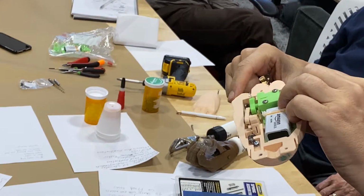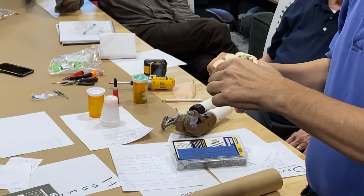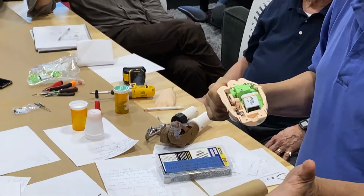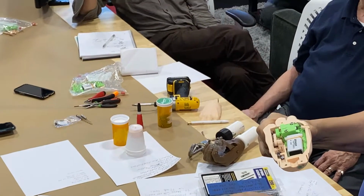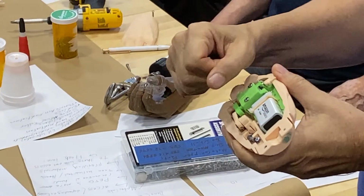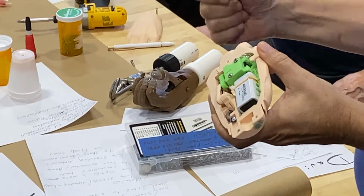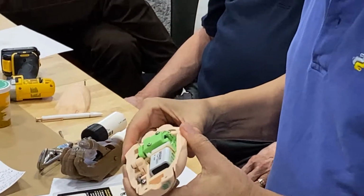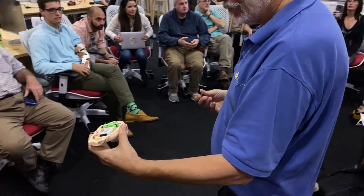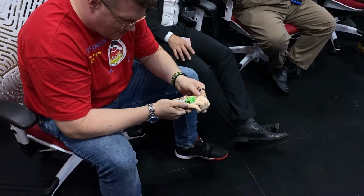So the magic, and you've got to think it through and watch it a few times, is that once you press the button, the cam allows the stay-on circuit to function. So the motor goes a full rotation until the cam hits the pole, tells stay-on to stay off, and it stops again. So there's a little logic switch built in, and you can play with it and see how it goes. No electronics, no micro switches, no soldering.